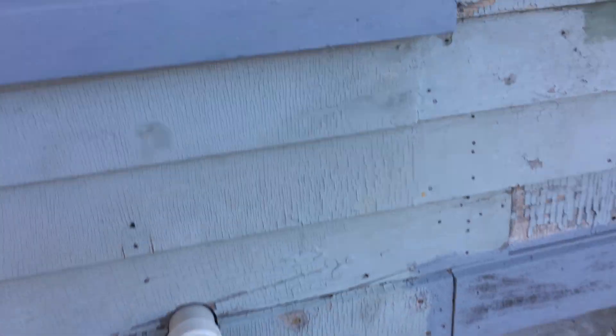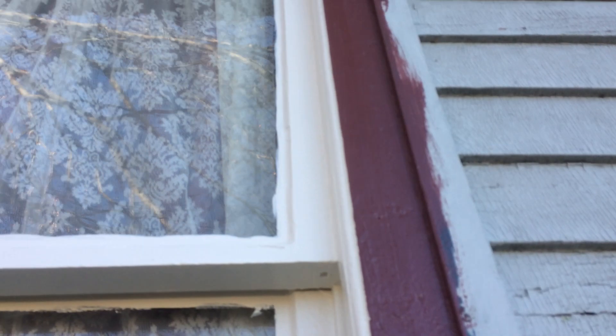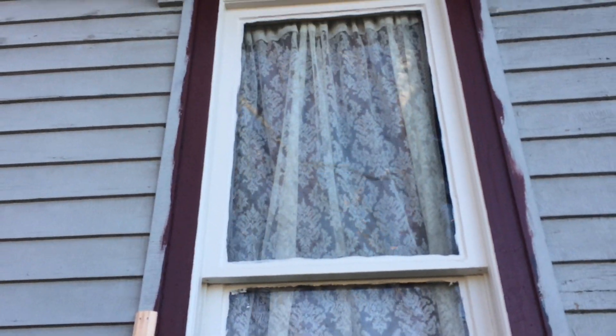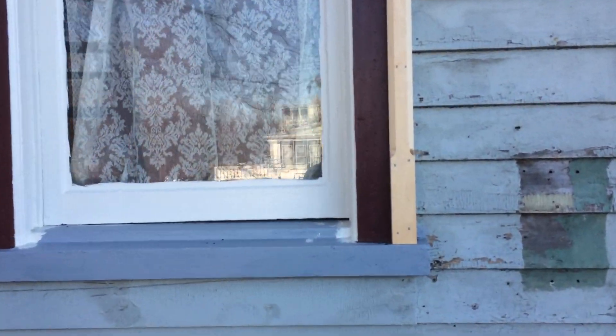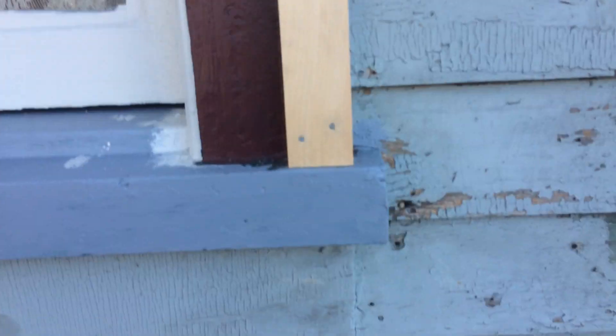These are some of the last windows I need to do on this house, so I thought it'd be a good time to get a good video of it. You can see this ridge here — the window looks fine without any additions, but I'm adding another molding all the way up through, and then the storm window will go in here. I'm nailing them in really good and then I'll caulk any of the joints.